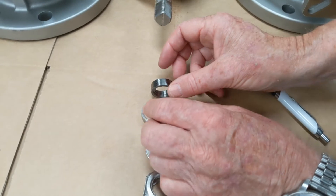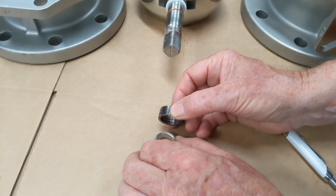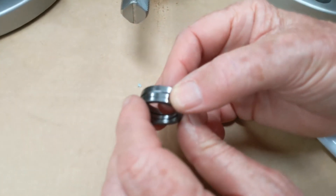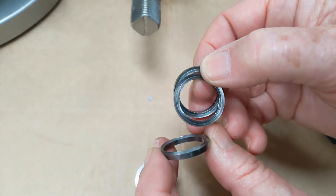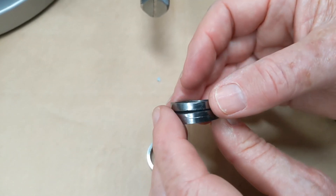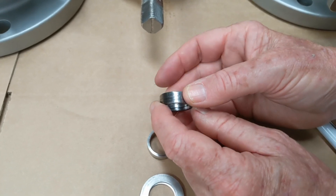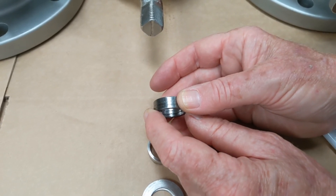The Belleville washers act on a set of chevron graphite washers. The thrust comes from the Belleville washers through a slider to the chevron washers — they're CNC machined and have a cone face on one side and a recess on the other, so the cone face seats into the recess. This assembly sits against the face internally inside the stem, and any compression of these crush washers forces the chevron out to seal on both the internal and external parts of the shaft.